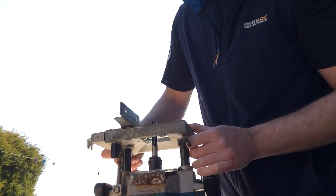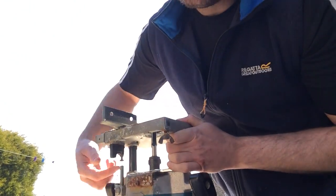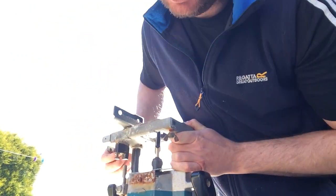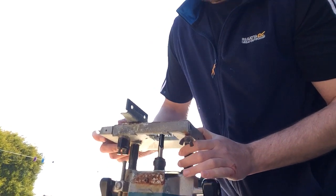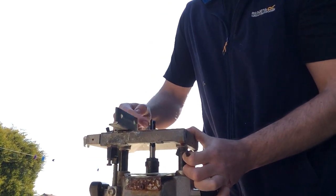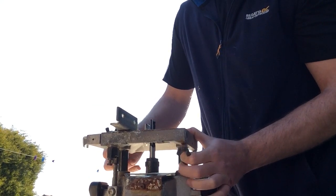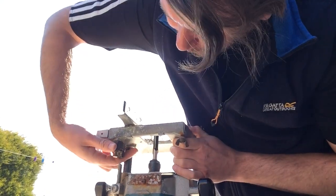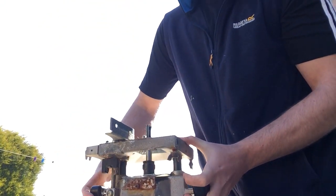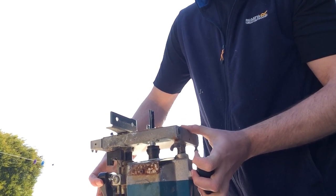Once you've done that first pass, you can bring it back up, turn it round to the next setting, which should be a bit deeper, and push the router down to go a bit more with the cutter showing — so another sort of five mil deep. And then once you've done that, you can go round to your third setting, do a pass, push the router down, and it'll go a fair bit deeper for the final pass.